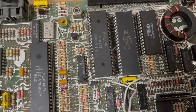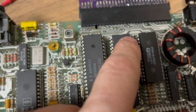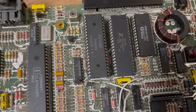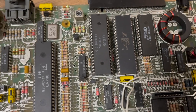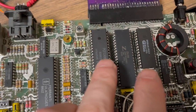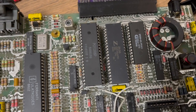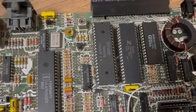This is where the story went south. What I observed was that A10 — this little pin — was always on zero, always on ground. So I checked the diodes for shorts, and there are two other circuits connected to this pin: the PCF and the ROM. The ROM was the easy one — I socketed it and swapped it with another one, and that wasn't the issue. So I went for the PCF and replaced it.